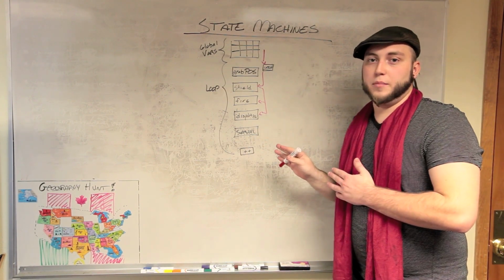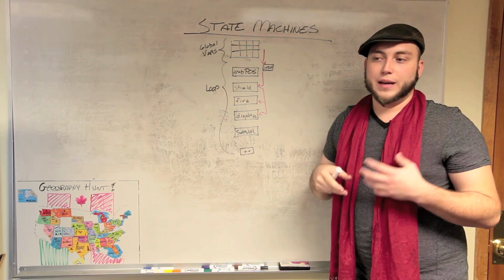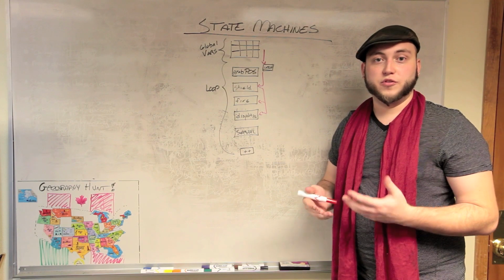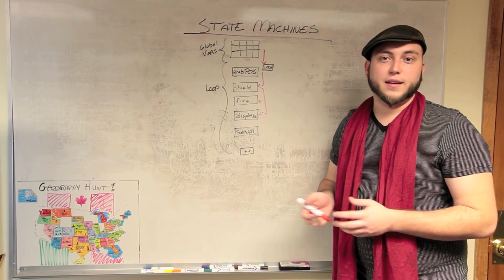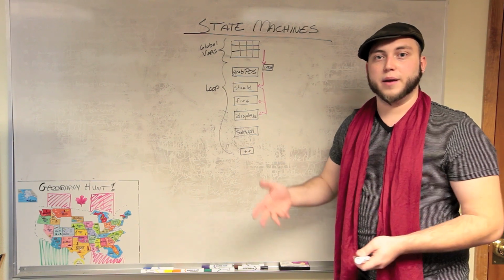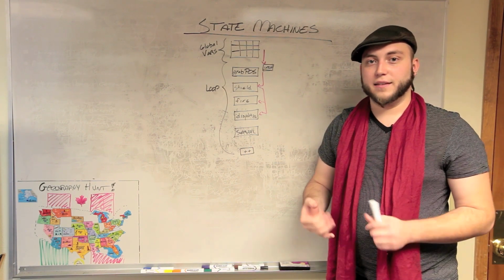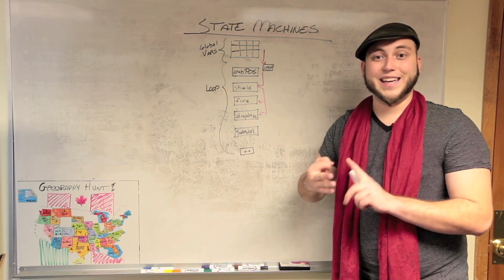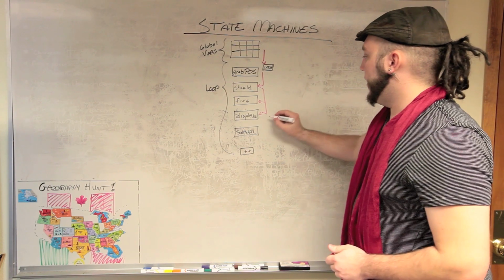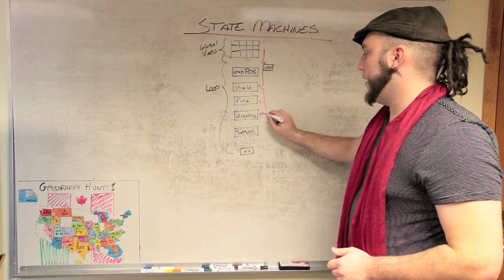The other thing that I had to build into the display module was blinking. When LEDs blink, they need their own timer. So I created a variable just called blink state, and all blink state does is it flips its state on and off every couple program cycles. If I want an LED to blink, instead of turning it on or off, I just make it equal to blink state. The display handles blinking and it handles all of the display, and then once it's updated, it dumps into serial.